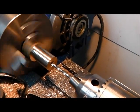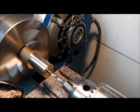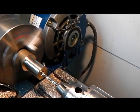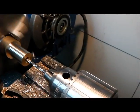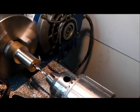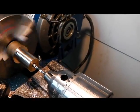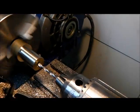We've set the drill to the end of the material, so we can now very gently start drilling the pilot hole. It's quite important to clear the drill at regular intervals, otherwise it will tend to snatch with the bronze — brass is much the same once it clogs up. I don't really want a drill bit stuck in it.